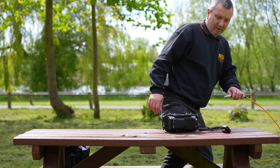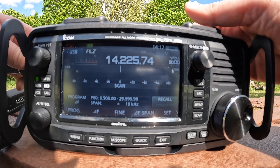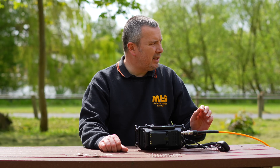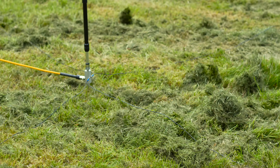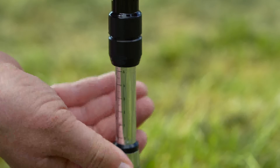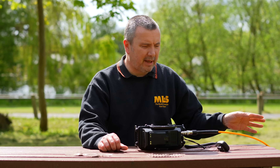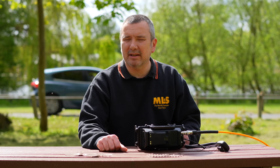There we go. So we now have the coax that we're going to connect to the radio. Let's just recap what we've done with the antenna. We've put the ground spike together, attached the four radials and pulled them out, then attached the antenna and adjusted it according to the graph in the instruction sheet to the correct height for the 20-meter band. Then we've attached our Potaflex coax and I think we're ready to see if we can make any contacts on 20 meters.